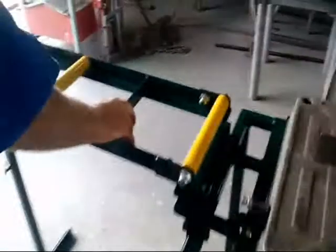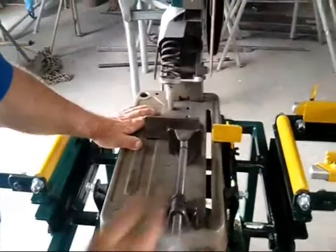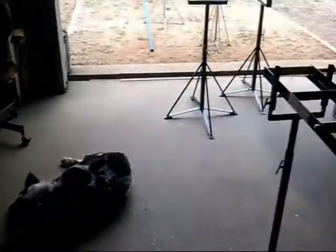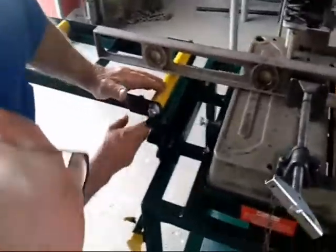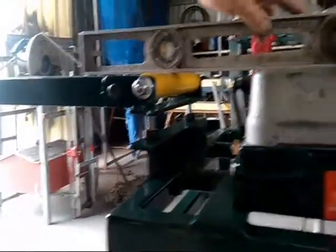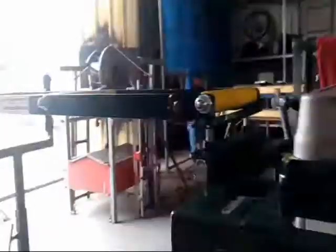And if you have, like this is using it on a concrete floor, but it can be worked outside on uneven ground or sloping ground. See, when you put your saw on, as I say, no saws are the same height, but what you do is you put a straight edge across your saw and you adjust these 2 rollers, the 2 rollers off the bench. There, you can see here where they're adjustable, and you either go up or down to meet. See, I've adjusted them just nice. They're just running on the bench, and then once you get them right, well, the back ones are adjusted to them.